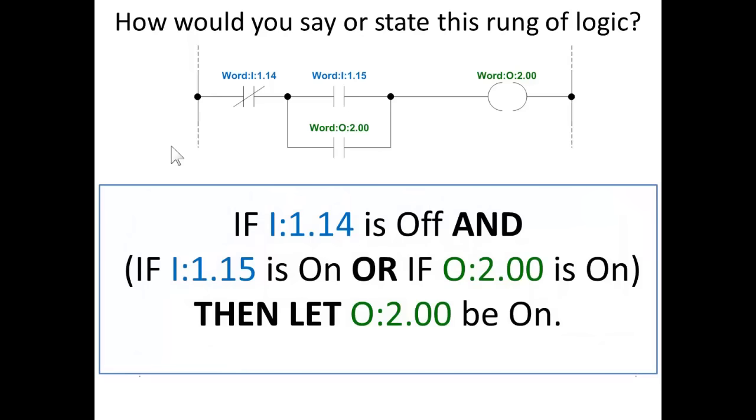So, if bit 14 is off and bit 15 is on, or if bit 0 is on, then let bit 0 be on. Now, this only works if bit 0 in the output word 2 is already on. So, basically, if bit 14 is off, look at bit 14 and 15 there in blue. If bit 14 is off and bit 15 is on, then that rung of logic is true. It then, with the output instruction, the OT, output energize, sets bit 0 of word 2 in the output image